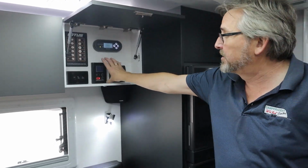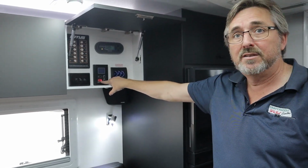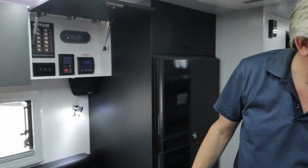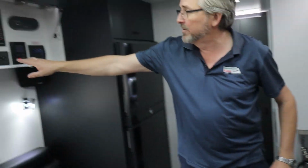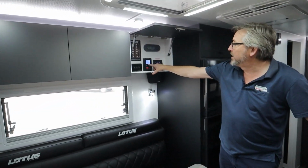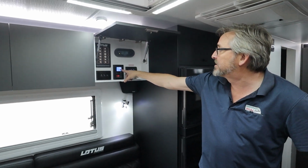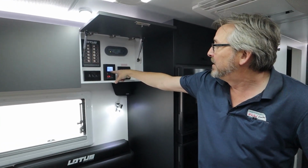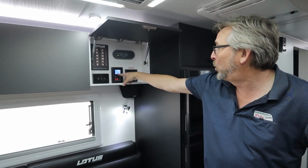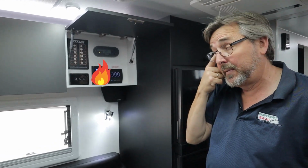This is the screen that tells you your hot water system is on. So that red light just tells us that little switch outside's on. If I run your hot tap, once I've turned your pump on, the screen lights up and tells us that at the unit out there, it's registering 28 degrees. A little gas picture will come up here as it gets hot. There we go. So that's now lighting up.